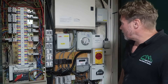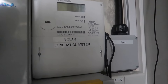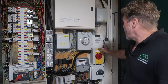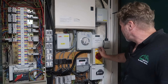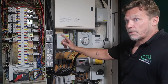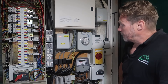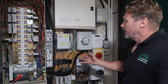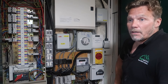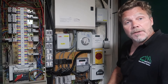I've managed to get this side finished - we've got our generation meter, the AC isolator, and I've brought our EV Ultra down into a junction box which I can jump out of with the CT cables for the CT clamps. As you can see there's hardly any room in here at all, so it's difficult to get things dressed nicely. I've run out of there with some flexicon and singles into the main unit, which we'll actually connect tomorrow as we've been sent the wrong breaker. But all that fiddly work is done and we can work back at the inverter tomorrow. It's past four so it's time to knock off.